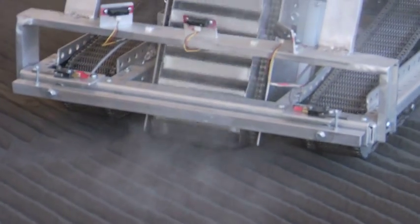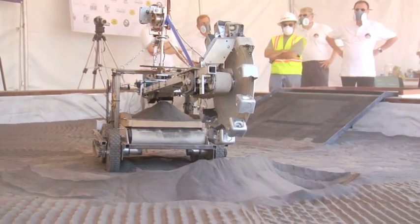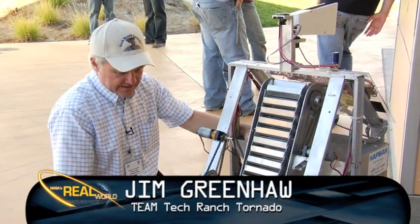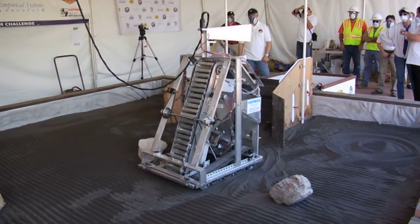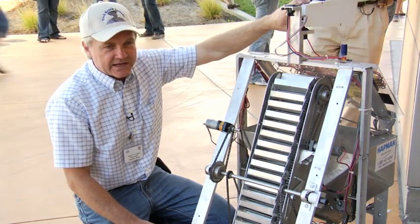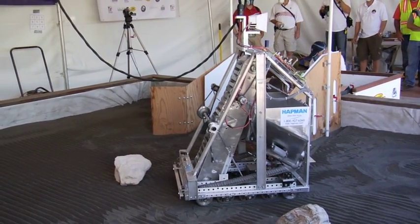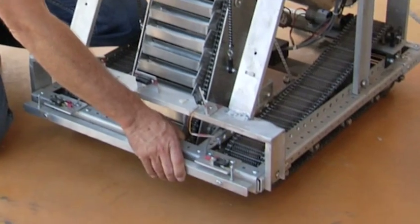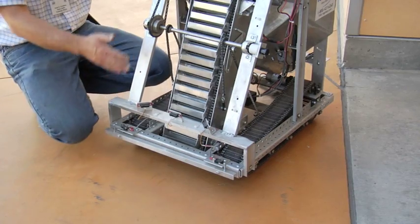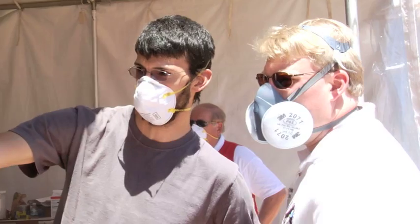The rules seem pretty simple at first: build an autonomous machine that can dig regolith, or moon dirt — in this case, simulated regolith comprised of crushed basalt. The task this year was to dig 300 pounds of moon dirt. The biggest challenge was that it was placed randomly in the sandbox and had to use some means of navigation to find its way around. There were rocks placed around in it, and we didn't know where they were going to be. Distance measuring sensors and a bumper with switches were used to detect those obstacles and drive around them. The fact that it was done without any human intervention at all made it even harder.